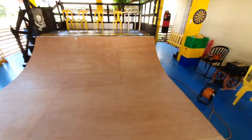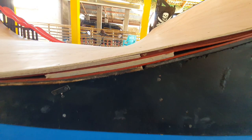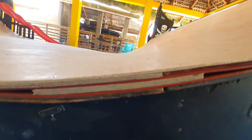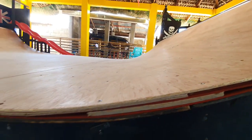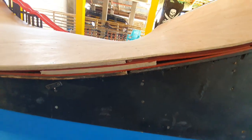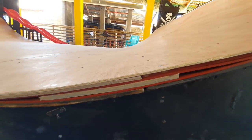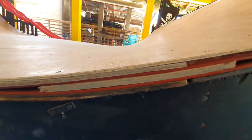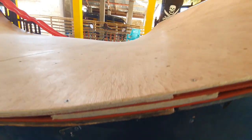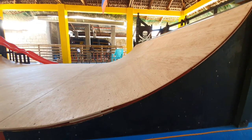And we made improvements with the coping. And, you know, when you look at the cross section, it's a literal sandwich. Now, this piece right here is a giant shim, because our transition was lagging right here, probably because we had 2 connective points there that were not directly over a 2x4. And so what we did in all those situations was put a big shim, and it really improved upon not only the strength but the transition.